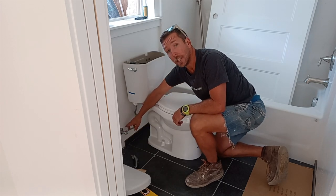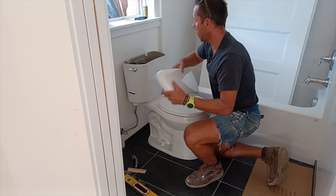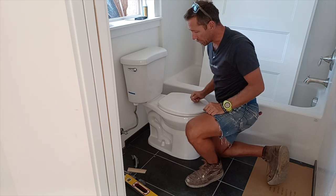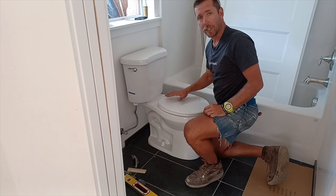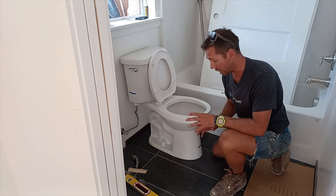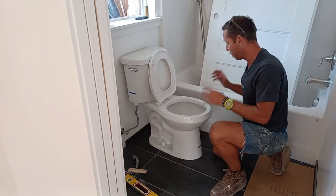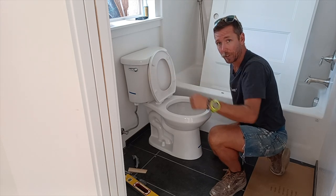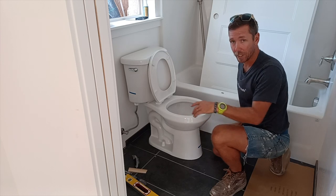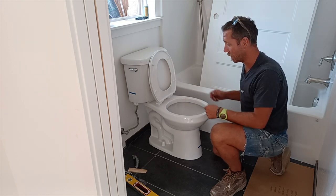Check the first flush — brand new toilet, $95, takes about five minutes to install, and the tenant gets a toilet nobody's ever used. Making sure there's no water pouring out the bottom, no drips, and the wax ring has a great seal. It's an accomplishment to have a sewage system fully working — from tying in at the street through laying the 2% DWV waste line and tying into the ABS waste line under the house — a lot of steps to get here.